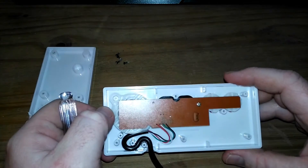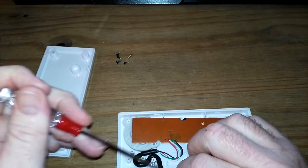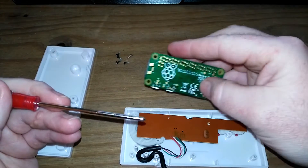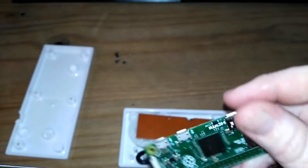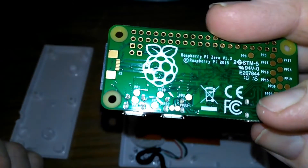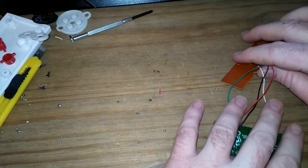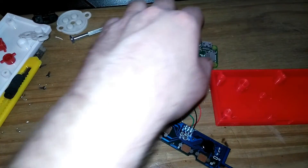That's what you've got inside — I showed this on a previous video, I'll probably link it somewhere. There's one screw holding in the buttons and the controller board. What we want to do is cut here and wire this board to two pins on the back of the Pi. These two pins for power and then the two pins here for data — I'll make sure to check before soldering things together.